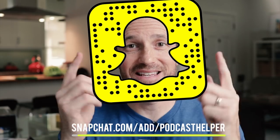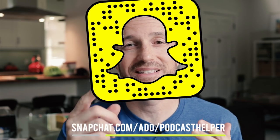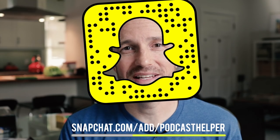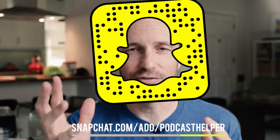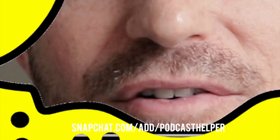Just as a reference, this is the audio coming from the Rode VideoMic Pro, which is plugged into the Canon 60D. I'm running it at plus 20 dB and bringing the Canon 60D preamp down low enough so that my audio levels are about minus 12 — somewhere a little below or above. This microphone is about two and a half feet away from you right now.